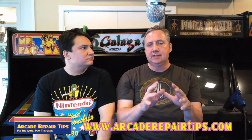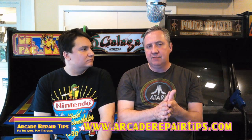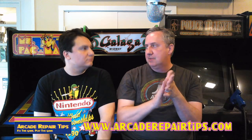Right. Normally on a wood cabinet, we just gunk it up and sand it off, and it works and fills in real good. We've actually got videos where we do that. But I know what he's talking about with that slick black. You just got to be careful, depending on how big a hole you got. Now, if you got a really big hole, you can fill it with other stuff first, and then come in with a light layer of Bondo. But Bondo still works really good.